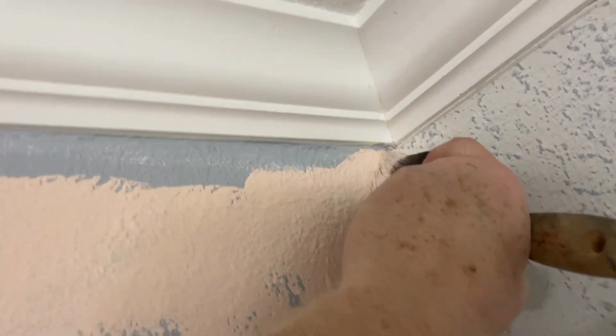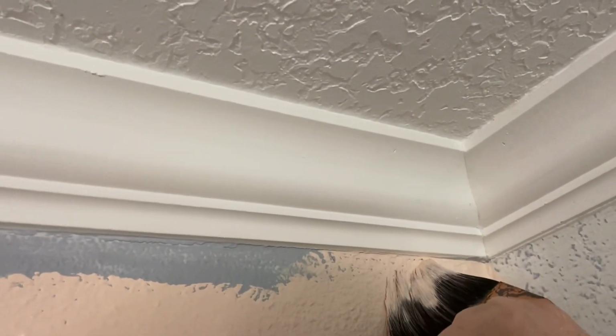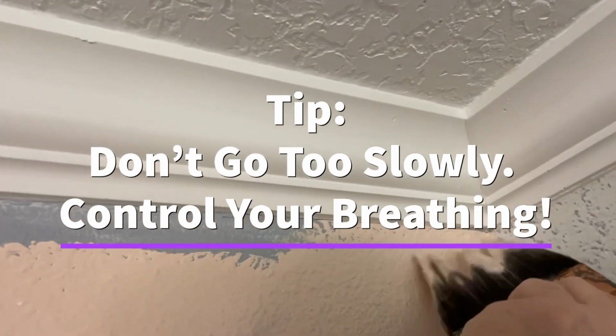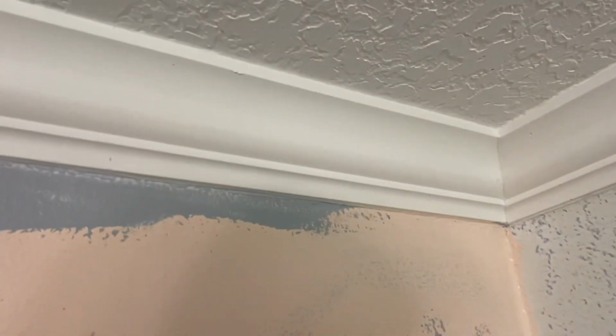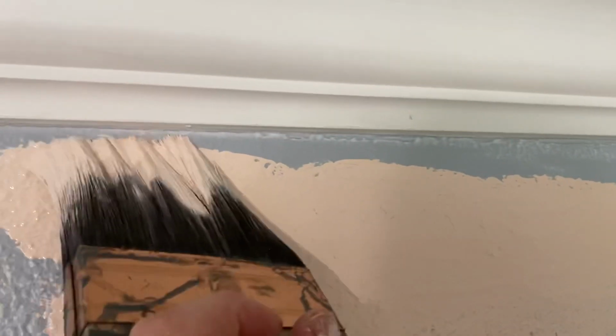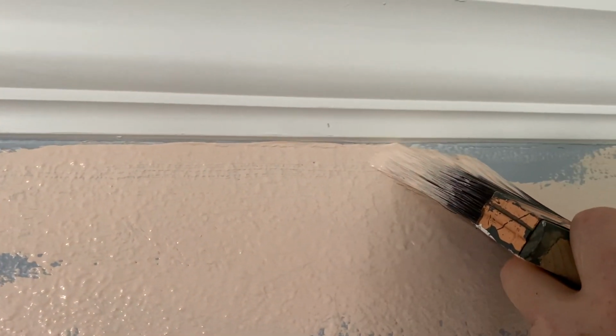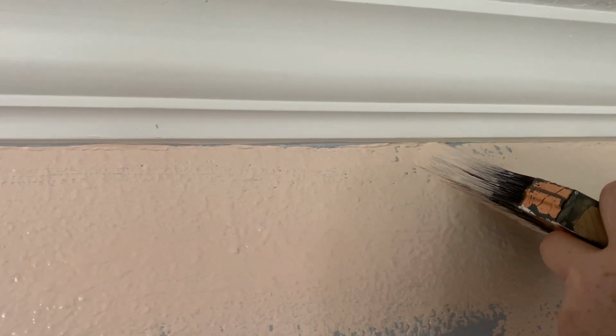I knock my excess off and I just go up to that corner there. And I start pulling a straight line. And really what you have to do is paint over the previous painter's mistake, because they were very excessive with their hand movement. And once we're out of the corner, we could move a little faster, right? And we could also go in the opposite direction. Again, the finished direction is not back and forth. It's going to be the same direction.